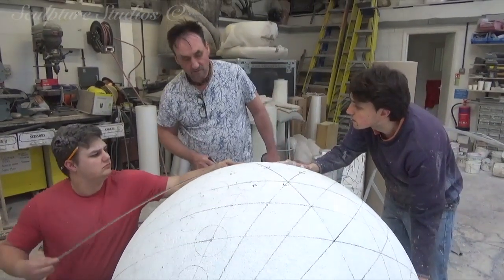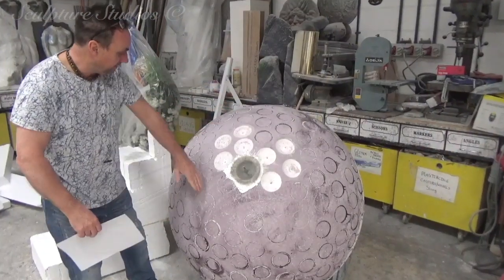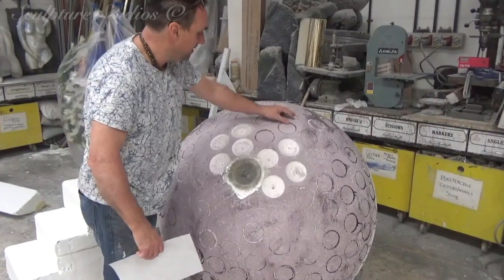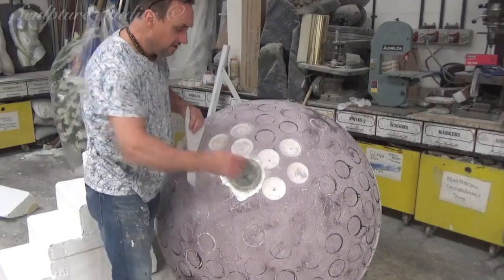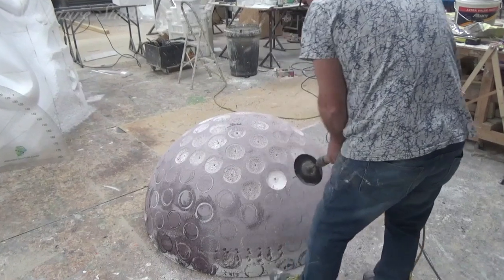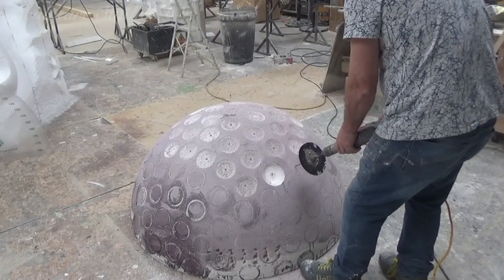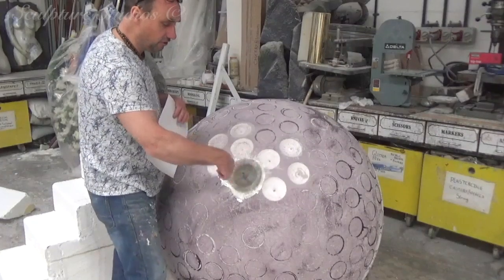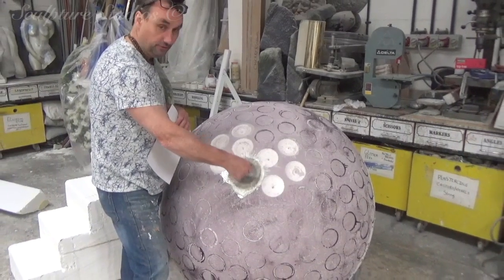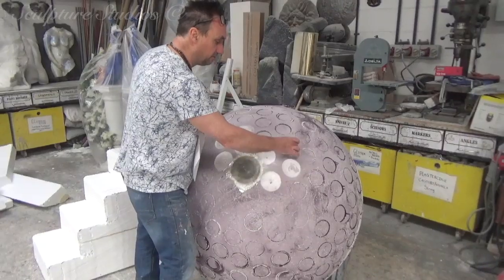We've decided on our layout of the whole segments of the ball, and everything's going in stripes the way they should be. When I was drilling out my segments, I found that some are going just slightly deeper than others, and if they went deeper, they went slightly wider. So what I've done — I've chosen one really nice one, taken a separate mould, and I'm going to make that my new tool, so every time I push in, they all end up identical to one another.